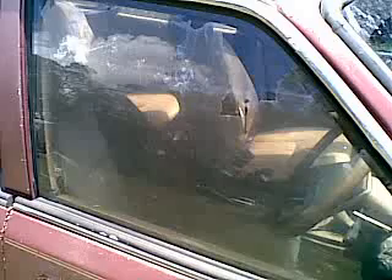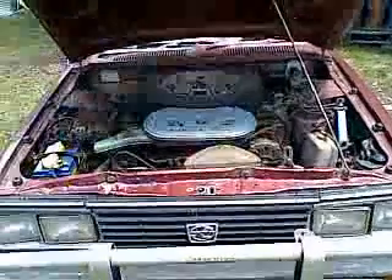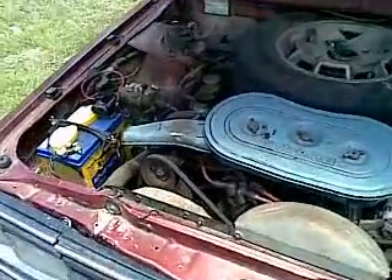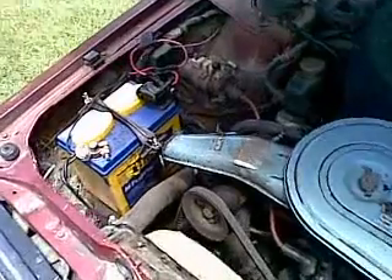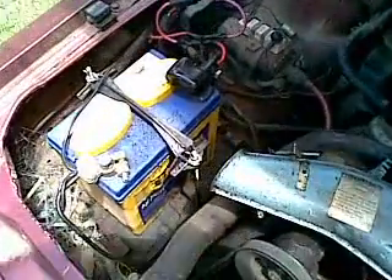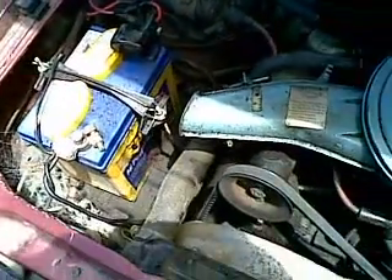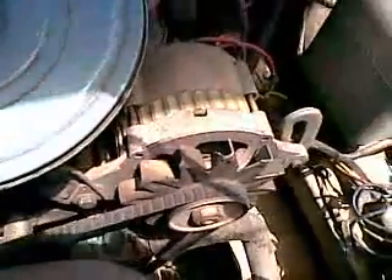Maybe I'm a little bit slow on the uptake, but I've been aware of how much power it took to get electricity out of an alternator ever since I gave up on windmills. But it wasn't until 3 years ago that I paid attention to what's happening under the bonnet of a normal motor car. The trigger event was when my electric windows were failing to operate. My son is an apprentice auto electrician, so for my birthday he borrowed my car to see what was wrong with the windows. He gave it back a week later and said: 'Dad, your battery was half flat. It took 35 minutes with the engine doing 2000 revs with a 2 to 1 step-up belt driving the alternator, so the alternator was doing 4000 revs at its peak efficiency.'